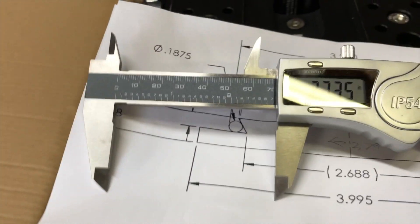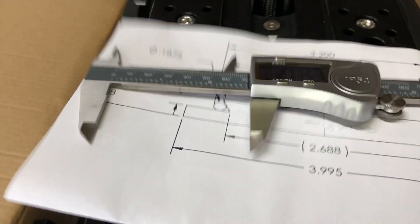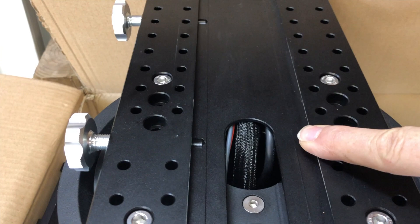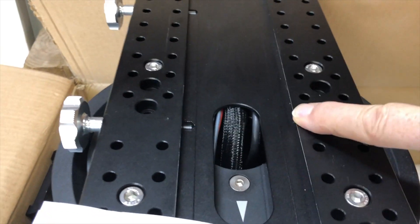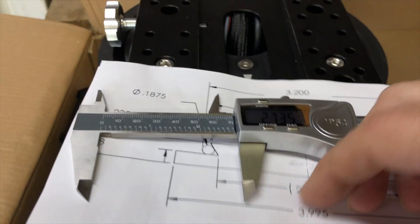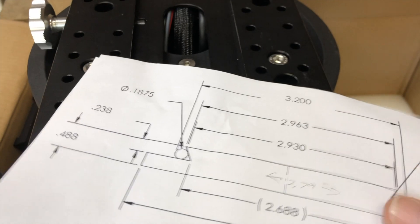The difference we're talking about here is 41 thousandths of an inch. So your clamp is leaving 41 thousandths of an inch of slack for a dovetail bar that's made according to these dimensions. Again, that's not much.